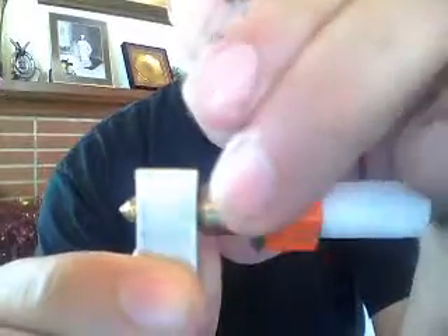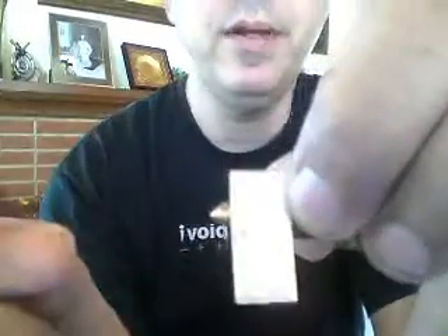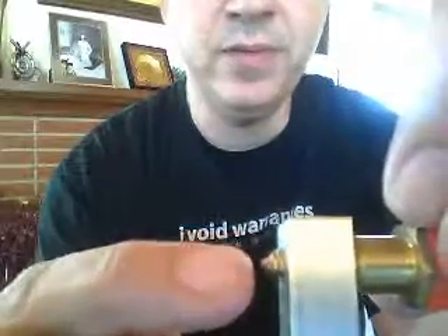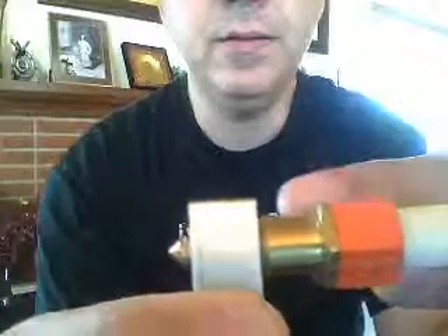I have my brass coupling here. I've actually cut it off right here at this point — there's nothing else from the brass fitting entering the aluminum block. I've taken off the other part and put a ¼ inch thread in there, and this tip that you see now is not the MIG tip anymore. This is actually a ¼ inch brass screw that I have screwed in from the other end of the brass coupling.